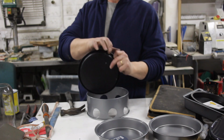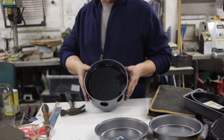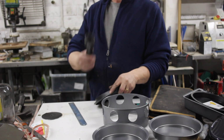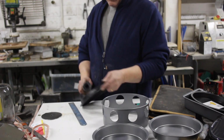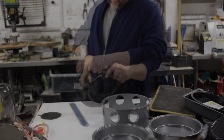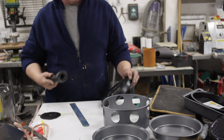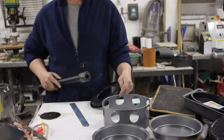Your aim is just to bend that top over, because then when we turn that upside down, that will be a force fit in there. But before we put that in, we need to drill a large hole in the centre. That's a large hole. Now we cut a large hole like that, we need to round off the edges. So I just do that by eye and a lump of metal, and you just tap it gently and the edges will round over where they were sharp. Obviously changing the angle as you tap. Now it is a bit of an acquired skill to do that, so you can use a former and do exactly the same thing, but just round off the edges. You don't need to round them off, you could just file them. But I love metal work!